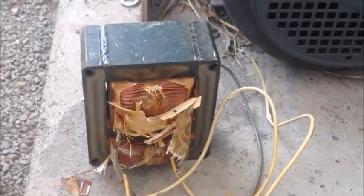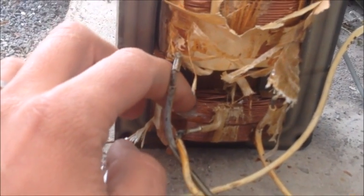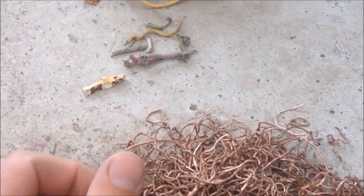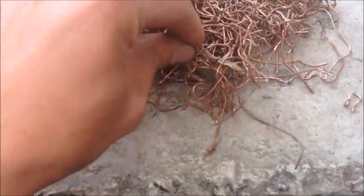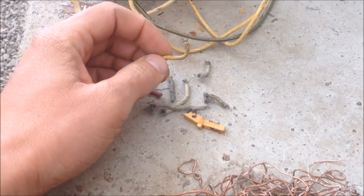Here's what we found with the bigger transformers. I kind of busted this one up a little bit so you can see. The wire in this is actually a pretty good size — it's a pretty heavy gauge. This is what it looks like when it comes out of the hammer mill all cleaned. I think this is actually probably number one copper because of its size. We had the same problem — we weren't clipping off the wires off the transformers, so the insulated copper still comes through. Every once in a while you'll get a heavier piece of plastic. The wire is so heavy gauge that I could really increase the air velocity in the zigzag and I could probably separate it out without any trouble.